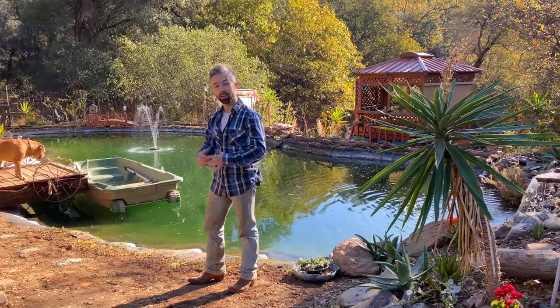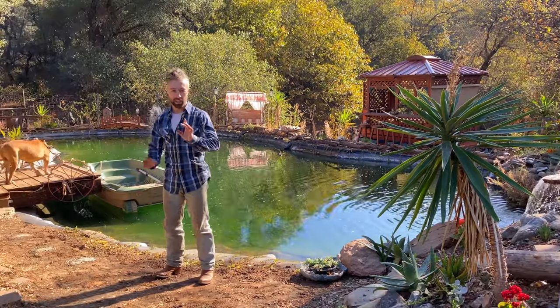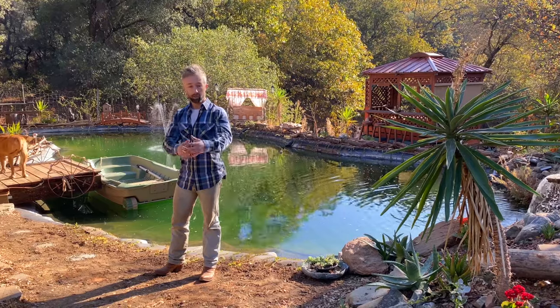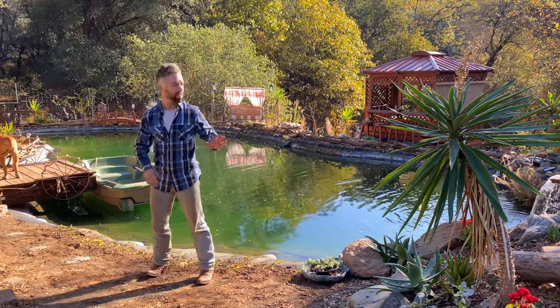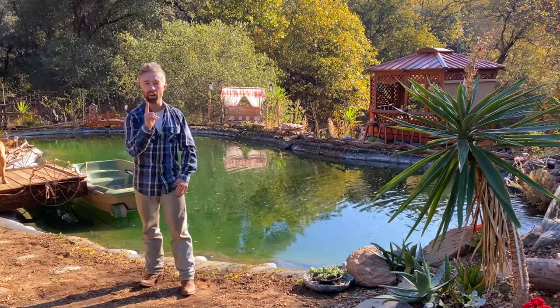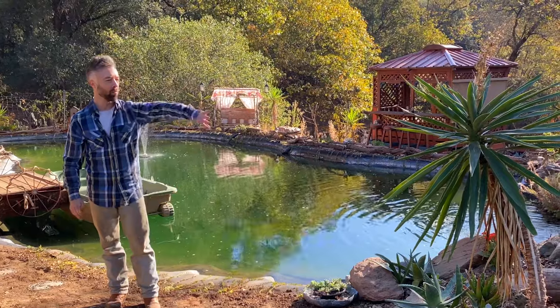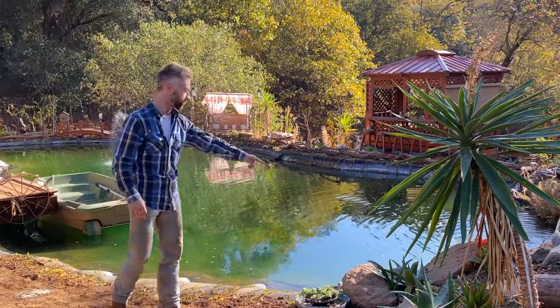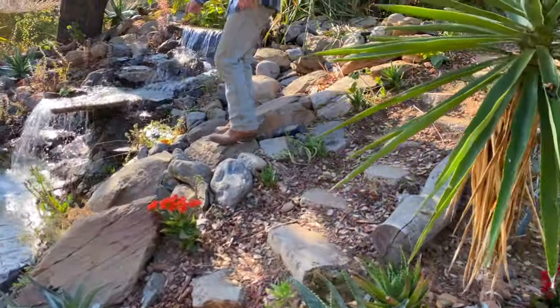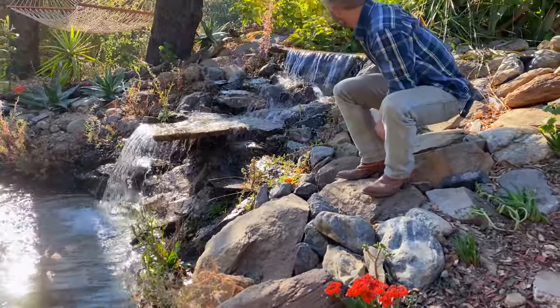So you definitely want to build a trench. Actually, the only spot that you don't have a trench, because when you get the liner, when you calculate it, which hopefully we can talk about in the next video, you want the bog and the waterfall section and the main pond section all one liner. You want to calculate that as one liner, not two, but one, okay? So all along the perimeter, a trench except right here. This is all one liner from my main pond all the way up to my bog.